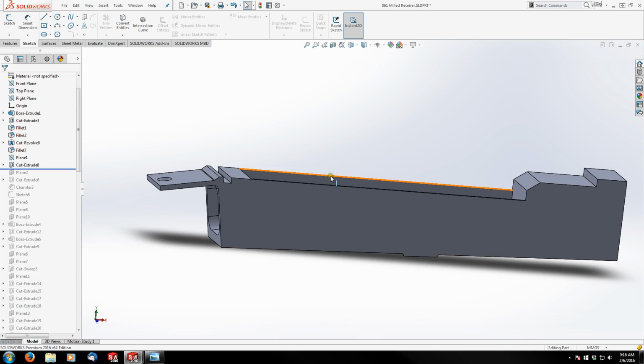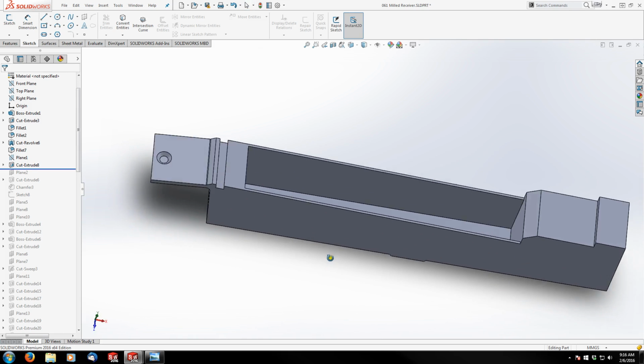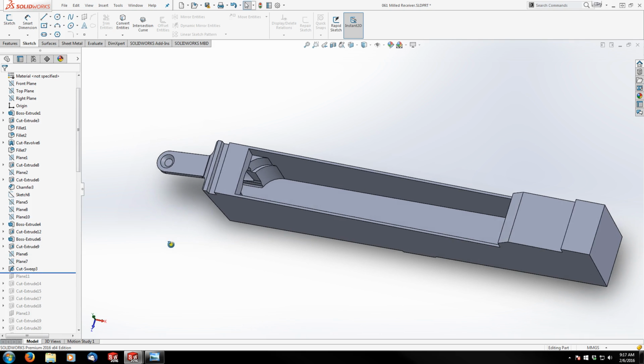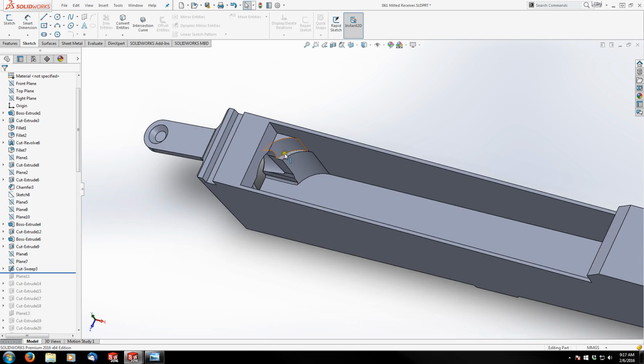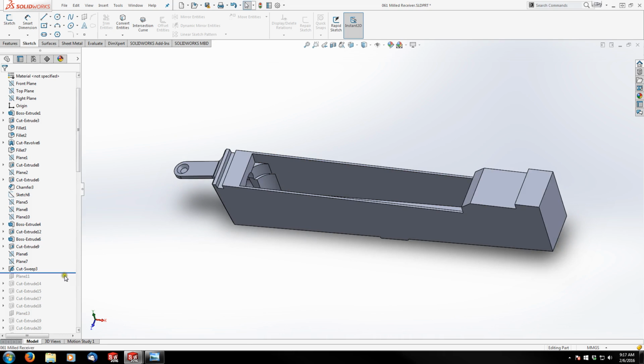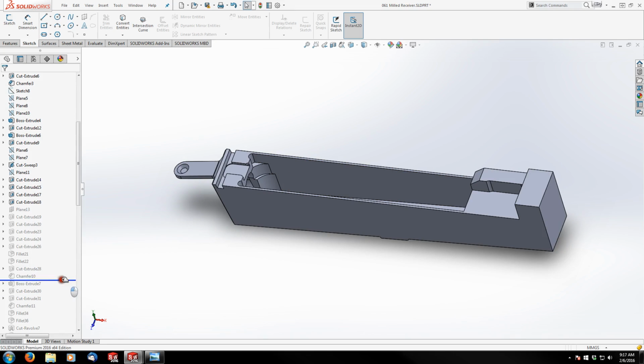This is the one that I had a big issue with. He hollowed out the entire receiver, and then he started building it back up from the inside. And I explained to him that my problems with this are that a lot of the angles and edges you're creating in here, this isn't so bad right here, but as we keep going here, you'll see a mill isn't actually going to be able to do some of that stuff. Let's just keep going.